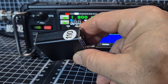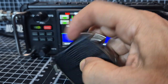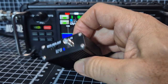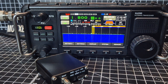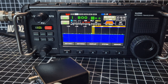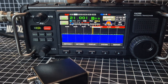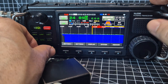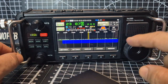This little gadget adds 110 megahertz, as printed on the side, and it's not expensive — only about 25 pounds. It also amplifies your normal signal as well; there's a switch and you choose if you want it to work as an amplifier or for airband. If I flick it to air, the blue light comes on — it's a charged-up device. I want 133.850 MHz, so I just add 110 to that, meaning I need to tune to 23.850 on the HF side.